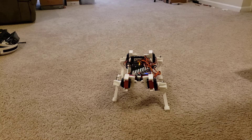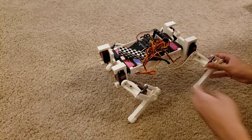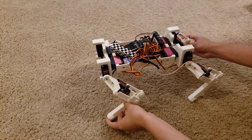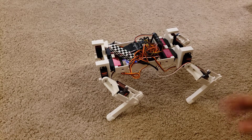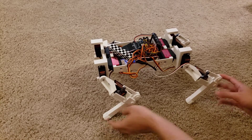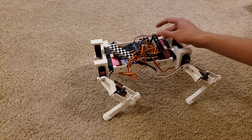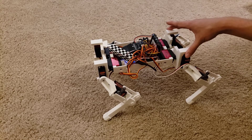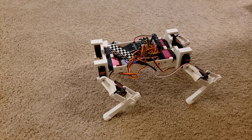That's pretty much the robot at this point. It uses the dynamic gait, so it lifts two legs up at each time and sort of falls a little bit, which is part of the normal walking gait — as opposed to the statically stable gait, which lifts one leg at a time and pivots to a more favorable position for your center of gravity, doing that individually for each leg over and over. The robot doesn't have too much intelligence right now — there's no feedback.